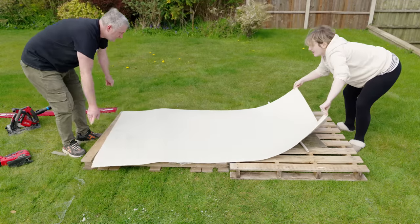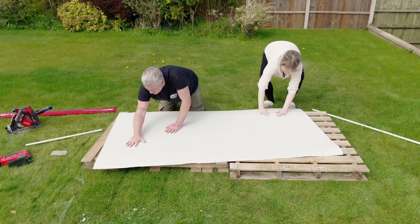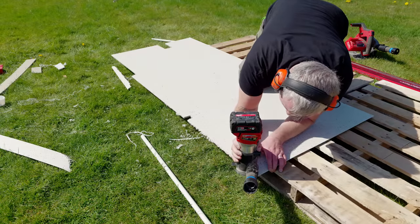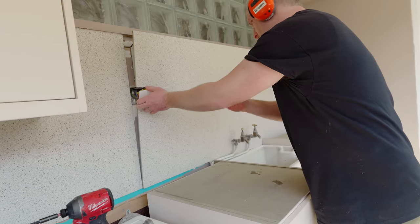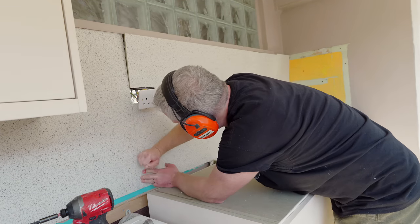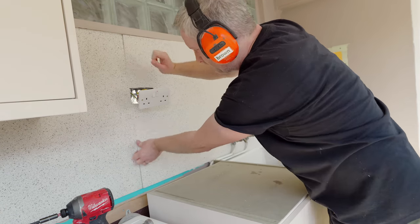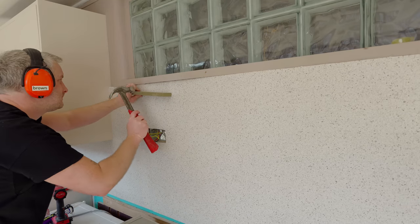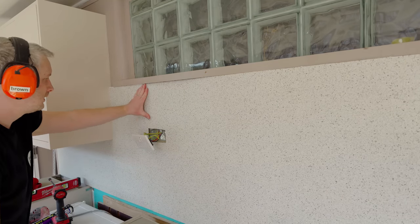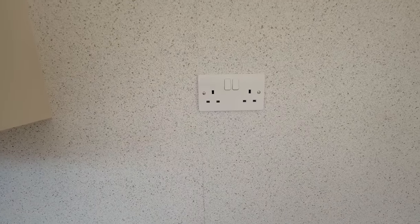Because this panel was quite big I asked my wife to help me lay down the vinyl, just to make sure that it was overlapping on all sides. I couldn't afford to make any mistakes here as I wouldn't have enough vinyl to complete the job. Initially I thought I'd done a really good job on the join, but when I get it tight at the top the bottom seems to pop out a bit — I guess there's a bit of a hump in the wall at the bottom. Unfortunately the bottom join kept springing out a bit, which was really disappointing, so I decided I'd come back later to see if I could fix the issue.